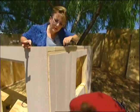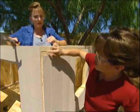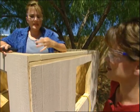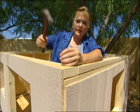Now that the bottom is secure, we're going to attach the top plates, which are these boards right here. See how the two two-by-fours overlap? That just helps to tie the corners together better and makes it a little bit more secure. I'm going to use three-inch framing nails to nail this in place.